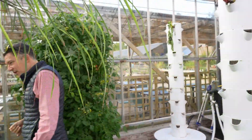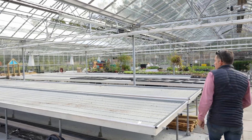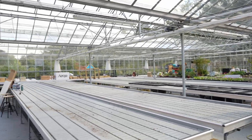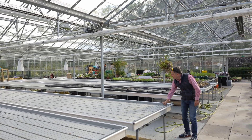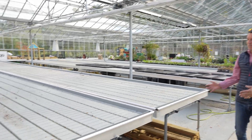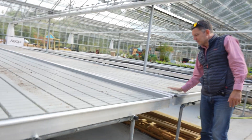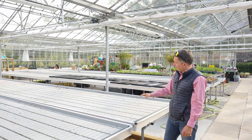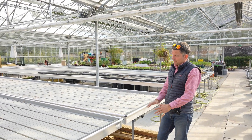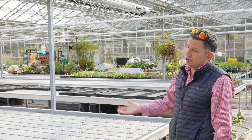We're going to turn around and look at this rather interesting thing — it's called a flood and drain. This is a big old bench where you put plants all the way down it. It moves back and forward so you can stack things and walk down the centre path. Underneath, there's a big bowser of water that floods water up onto the top, holds it for about four minutes, waters whatever's on it, and then dissipates back down again. It takes care of your entire watering needs — super simple to put in and massively effective to reduce labour costs.